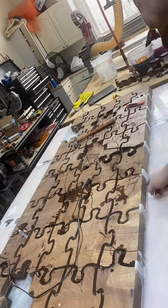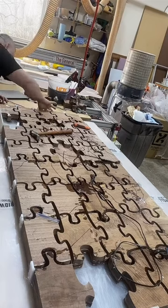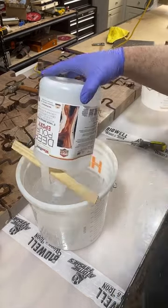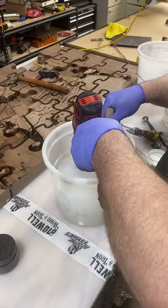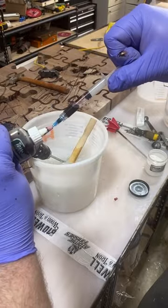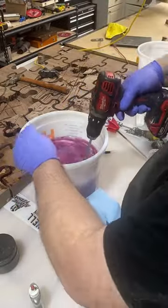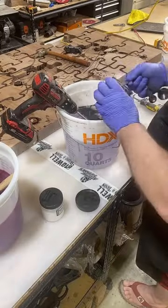This is doomed to fail — I'm almost positive I'll end up with leaks because I mixed up my epoxy before starting the silicone, and you have to let silicone dry for 24 hours before pouring. We're pouring tonight anyway. As always we start with two-to-one deep pour epoxy from Wise Bond — I'll be giving away a few gallons soon. We mix in some pearl pigment and then some TransTint Bordeaux which gives a nice deep magenta, and then we make some black using black mica.